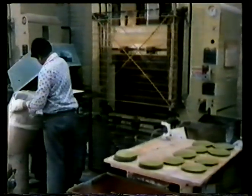After preheating, the polymer is then placed in the mold. Both halves of the die are kept at a constant temperature of 150 degrees centigrade. The mold is closed under a pressure of 2 tons per square inch, and the polymer flows round it. The mold is kept closed while the cross-linking is taking place.